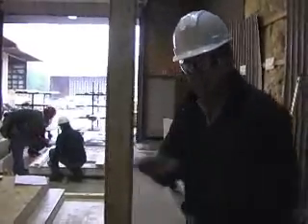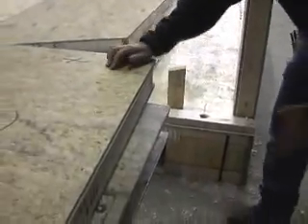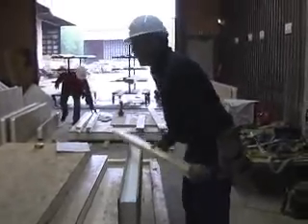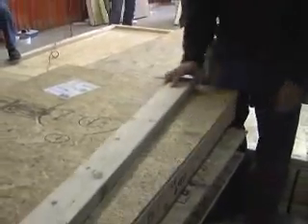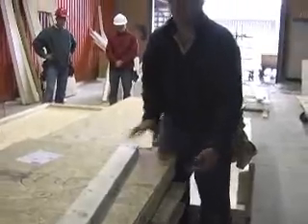We need to marry this panel up to this panel right here. Notice that this panel came as RTA, so this piece of lumber was already inserted. Instead of inserting this piece of lumber in this panel, what we're going to do is insert it onto this panel. On the back, a half an inch, up an inch and a half from the bottom, we're going to put two beads of adhesive, because that's where air is most likely to come through in that corner.